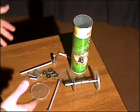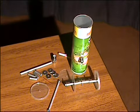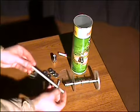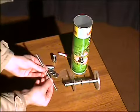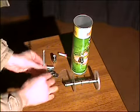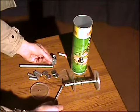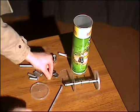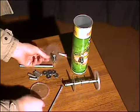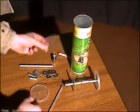Right, to make a simple Wi-Fi antenna out of just a Pringles can, what you're going to need is a 6-inch piece of aluminium tubing, a length of all thread with 2 nylon lock nuts, 5 1-inch washers, a 1.5-inch piece of 12-gauge solid copper wire, and a scrap piece of plastic like a disc. Another Pringles lid will work fine for that.